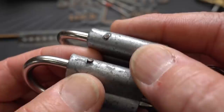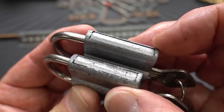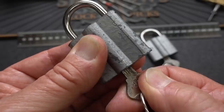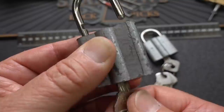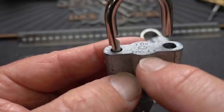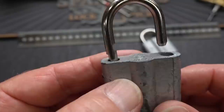They didn't spend a lot of time grinding that flat before they painted it. All the pins are held in by what looks like a little tin plate that was kind of hammered in and pinched in place. They are key-retaining — here's how: when the key turns, it will turn and now the key won't come out. There's no cutout on one side but there is a cutout on the other, so there's a mechanical lever inside the main cylinder that rotates, and when it's lined up with that groove there's enough clearance for the key to turn and be removed.